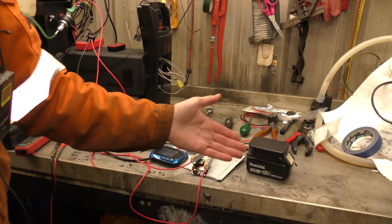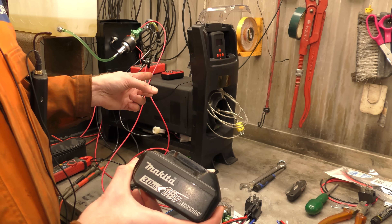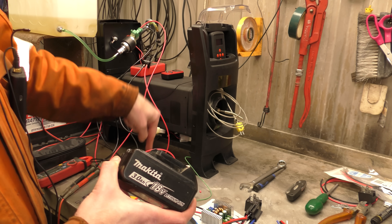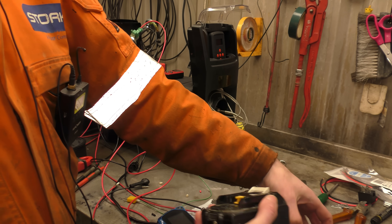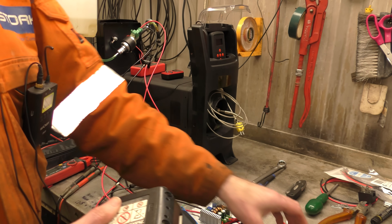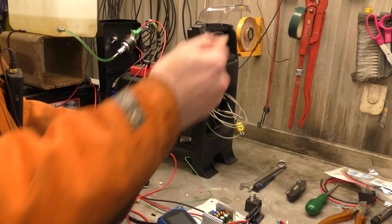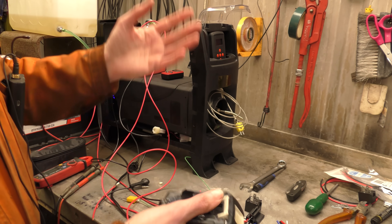Once you put a new battery back in it, everything will turn back on again and you can just fire it back up. My plan for this heater is to eventually take the heater itself, rotate it in the body, drill two holes in the outer metal box cover on the top so that hot gases exit outside rather than going down. Put the top back on, screw the battery adapter, tidy up the electronics — maybe put them in a nice box — and put that all on top. Then you'll be able to click on one or multiple Makita batteries, and you've got a totally portable heater you can put down somewhere, put your exhaust outside, turn it on, and it'll run until the batteries get low and then automatically shut down. You can just go and get a freshly charged battery, swap them over, and away you go.